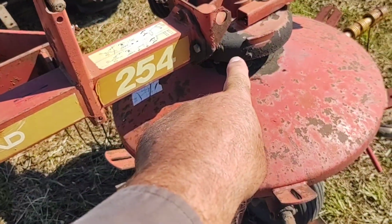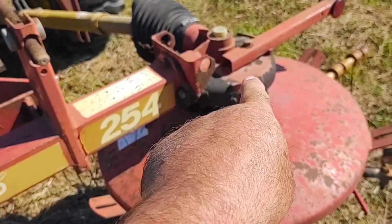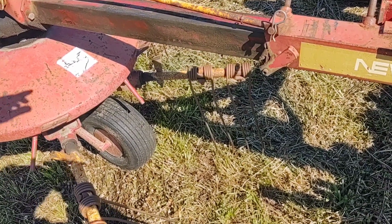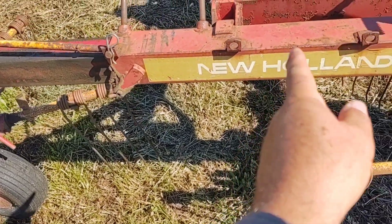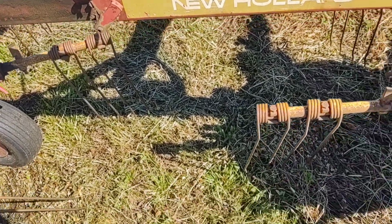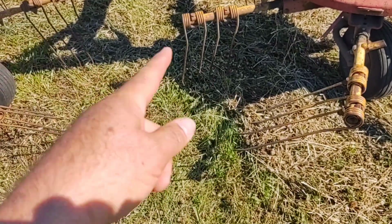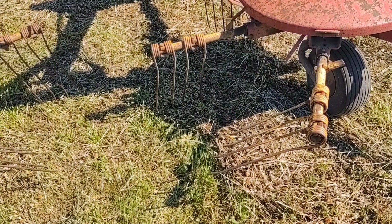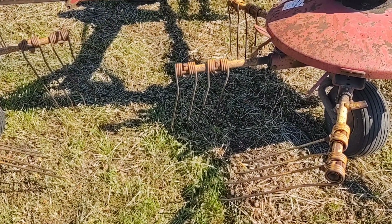There's a shaft going from this gearbox on this basket, where your PTO comes in, across to drive that basket. So there's a good chance if you go out too wide, you may drop off your shaft in there, and then you lose your timing between these baskets. Next thing you know, you've got arms hitting and clanging and banging, making more work than you really want to do. Anyway, hang in there. We'll get her set up and get her going.